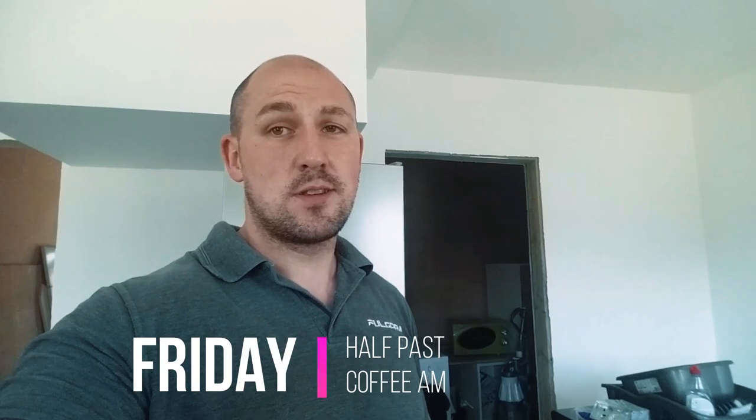It's a kitchen. I'm rewiring a kitchen, and the thing with kitchens is you don't really get a first fix, second fix scenario. It almost goes over three or four different stages. I'm at stage one. I'm gonna be running wires up, I'm gonna be putting sockets in the walls. But I'll also be laying cables ready for when the units go in. When the units go in, there'll almost be a stage two where I'll bring wires into the units.